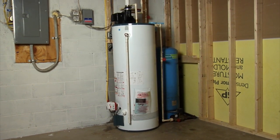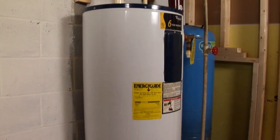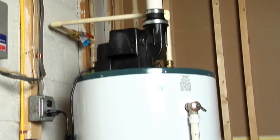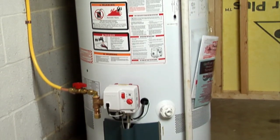The new model is superior for many reasons. The gas-powered one is more efficient and can heat water quicker with less energy. The old electric one was only rated at 58 gallons for the first hour, while the gas unit has a first hour rating of 87 gallons. The benefit to the homeowner is they would have more hot water for a jacuzzi tub, laundry, and won't have to worry about running out of hot water.